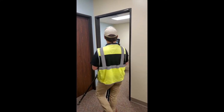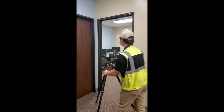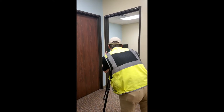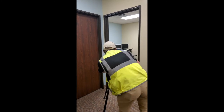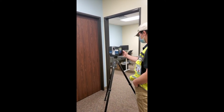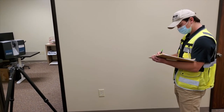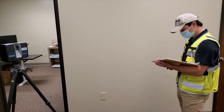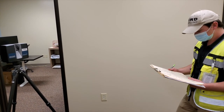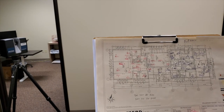The scanner can be set into the proper position to scan from. Typically this can be done in doorways to get the proper amount of tie-in scans to capture the content needed. Once in position, calibration can be checked to confirm levelness and position, and the operator can verify they're getting the content they need. The scanner can then hit go to run the scan. Once started or finished, the scan operator marks the location on the field notes, noting the scanner's position within the provided floor plan. This will be used later in registration to communicate where the scan was initially taken.